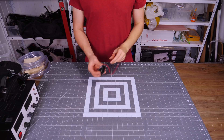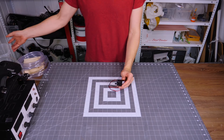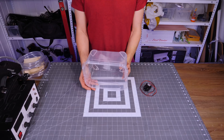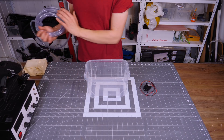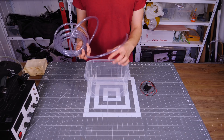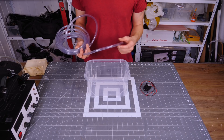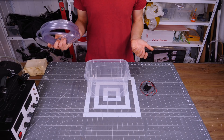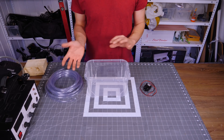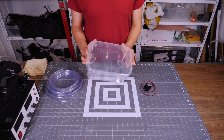The pump I'm going to be using is a little 12-volt DC submersible water pump. To contain all the plants I have this little plastic box that I just got at the local hardware store. What I want to do is run some plastic tube along the sides of the box, cut some holes in them, and when the water is pumped through it, the water will be distributed inside the box. Afterwards we'll need to add some electronics, maybe some grow lights on top, and of course the moisture sensors. But first, let's do the watering system.